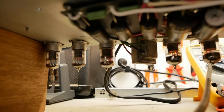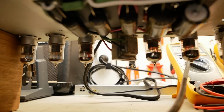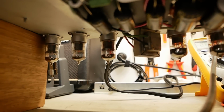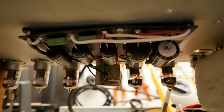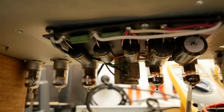All the preamps came up all right. No real microphonics or anything there, unless everything's maxed out. Obviously, you're going to get a bit. But they're performing okay. No serious noise. So they all get to live to fight another day. And I must remember to put the doghouse back on before I reach under this thing to move it. Ask me how I know that one.